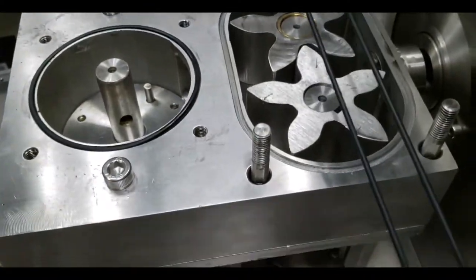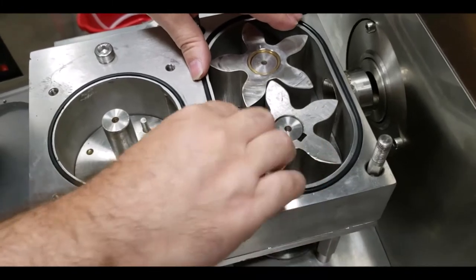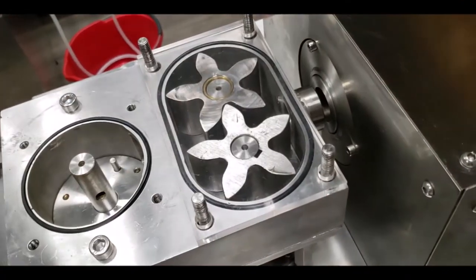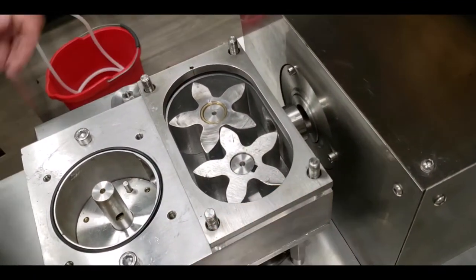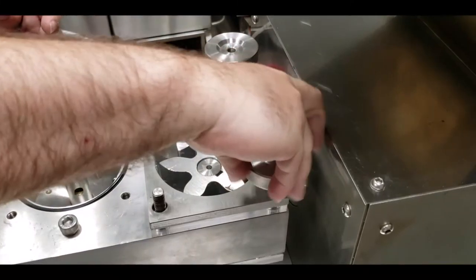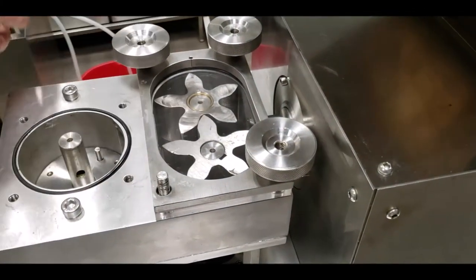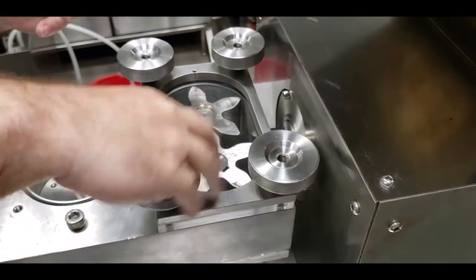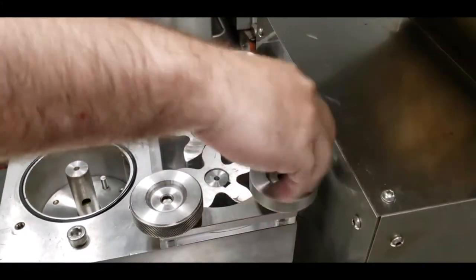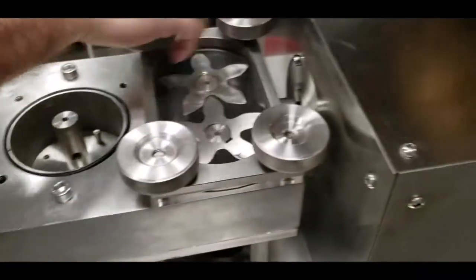As you can see it started to come back — just give it a good stretch again, and once this is back into its place, we are going to put in the plastic mold plate. Then we are going to put the steel plate back on, put on the rollers, the next roller, and the next, and the next. Very nice and tight — not too tight to strip the screw, just enough not to cause any leaks. Hand tighten — good.